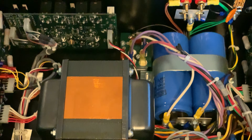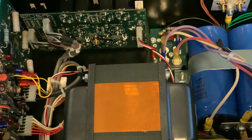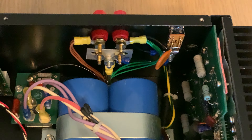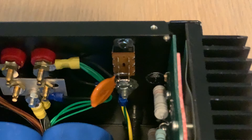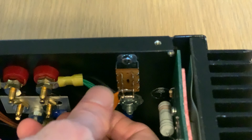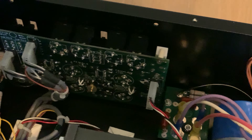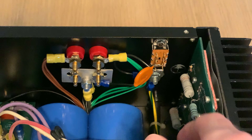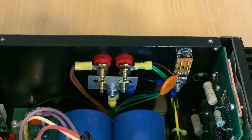Plenty of power reserve, and a very nice transformer with copper straps across it. The caps all look good. This is from 1997, so you should be able to use this as-is for some time without having to replace any parts. I did notice one interesting spot that clearly hasn't caused trouble, but they missed a soldering point — you can see it moving. I'll touch that up. Beyond that everything looks fine, but that's interesting because I believe that's the dead man's capacitor, so it's not a good thing that it's not soldered in correctly.